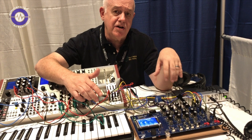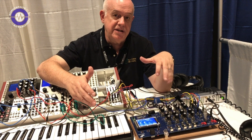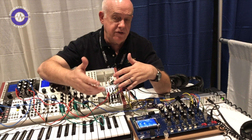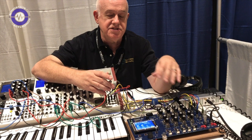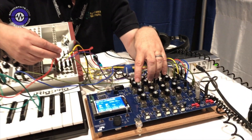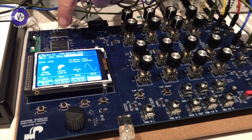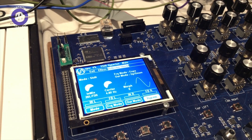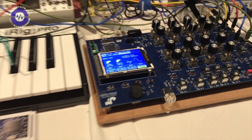What this is, is a stereo version of our two existing processors — the E560 Deflector Shield and the E580 Mini Sampling Delay — with added features. Just like we combined the generator and the morphing terrarium into the cloud terrarium, we're doing the same kind of combination and feature add. The difference is those were mono in, stereo out. This is mono or stereo in and stereo out, with four voltage control parameters. We have tap tempo, and most importantly a very powerful 480 megahertz DSP with 64 megs of SDRAM. We run our codec at 48 kilohertz, 24 bits, and we can do samples in stereo up to 22 minutes long.